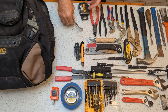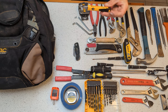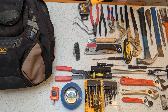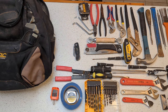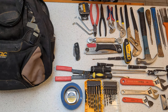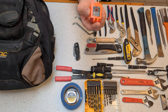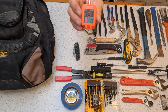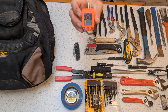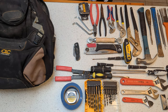We've got this voltage tester. I'm probably going to take this out of the bag soon because honestly I never really use it — I've got the little multimeter and the big multimeter, so this guy doesn't come in handy too much. And then finally for electrical, we do have an outlet tester. This is absolutely necessary. Make sure you get one that will test GFCIs as well. It's got codes on it, and those codes are going to tell you exactly what is wrong when you plug these in and they don't work. So we throw that in the front pocket too.